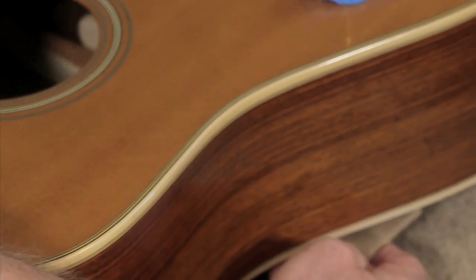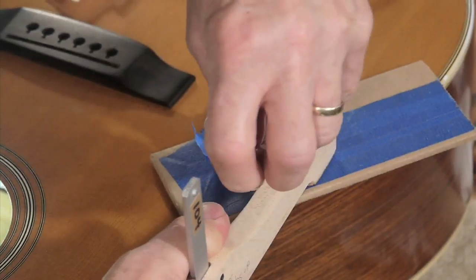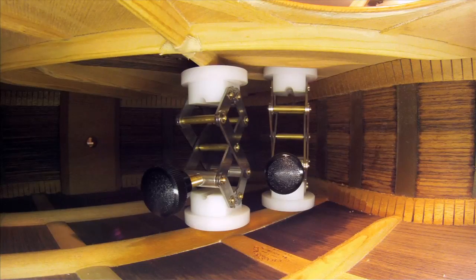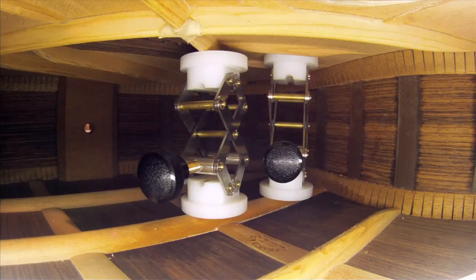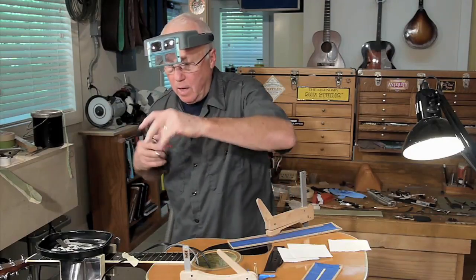This is the best. Now I'm coming in on the outside with my exterior caul. Now I'm getting a lot more squeeze out, of course. Those flat cauls on the outside of the guitar, especially on the back, spread the load. You've got 2 scissor jacks coming down, bearing on that brace. It spreads out their pressure a bit, and it supports the back from the outside, so you're not pressing too hard on the back. Now it's all just cleanup, and I can kind of relax now.